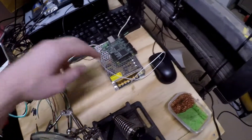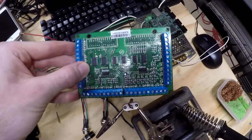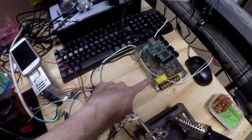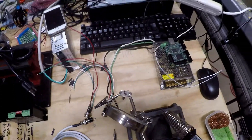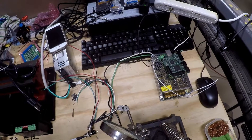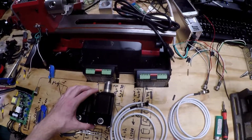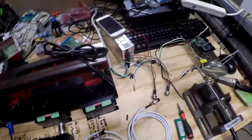Let's go ahead and get these wired up. We'll get the 36-volt power supply and the 5-volt power supply hooked up, and we'll get the SmoothStepper board installed as well. For right now, I'm going to skip the e-stop and the contactor and just do a quick wiring to the wall, just to try and get the motors going. I'm also trying to figure out what size box I need, so once I figure that out, we'll be able to put everything in a nice, neat, orderly fashion. But for right now, just for demonstration — just to see these motors move — I'm going to wire them up, set them up in Mach 3, and then maybe even play some music.